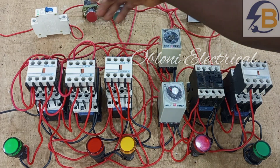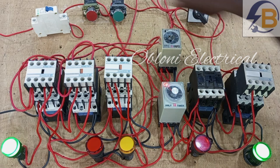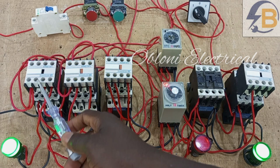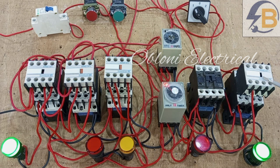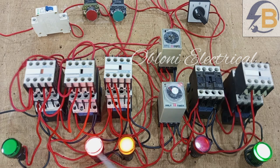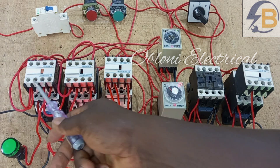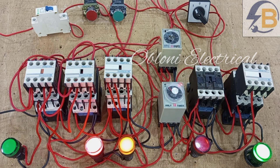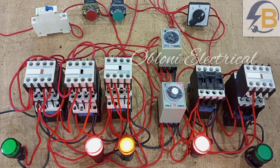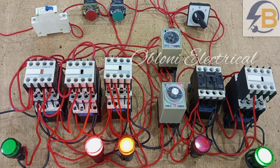There is a breaker here — before anything at all the breaker must be on. Now the breaker is on, then we press the start button. The low speed contactor has closed, so the green light is on. The bowl is also moving in the clockwise direction. Very soon it will change to high speed — this contactor closes for high speed and this is the common contactor. If we want to briefly reverse the bowl for proper mixing, we turn the switch to reverse — you can see the red light and the reverse contactor come on. Then we can turn it back again to normal movement.